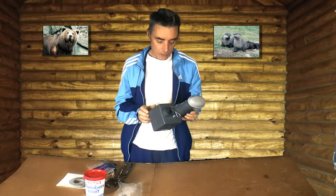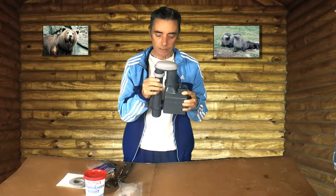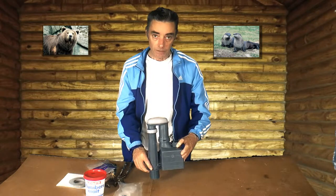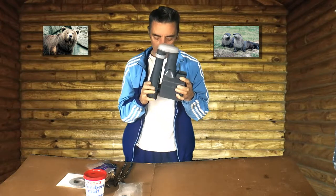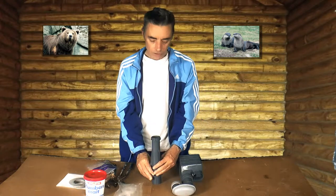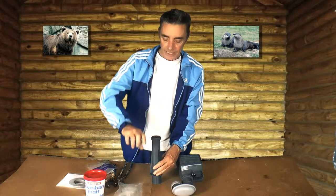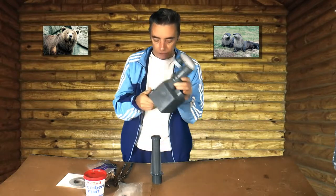The new one was also easier to install because it comes in three parts rather than one unit. The hardest part about putting a new siphon in is the stem that goes through the tank to the basin. With this one you can unscrew it and the body separates. So when I replaced this unit I could leave the stem in the tank and didn't have to split the tank at all. I did still have to remove the water feed because the shutoff valve was in the way, but it was hardly any trouble.